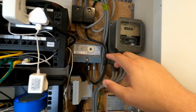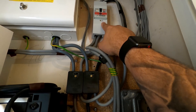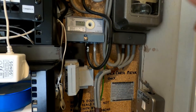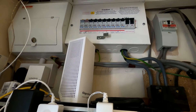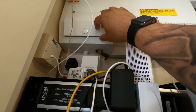I'm going to take you inside to show what we've got to deal with. We've got our main incomer, 100 amp meter, then it goes to this Henley block. These are 16mm cables and they need to be changed to 25s. We've then got a 100 amp, 100 milliamp time-delay RCD which is only protecting this circuit here going to our sub board. This meter is literally just the meter for the barn area, and then we've got two RCBO boards with a main switch - it's a TT installation.